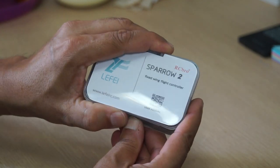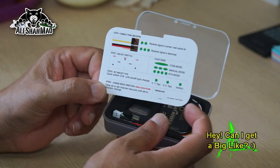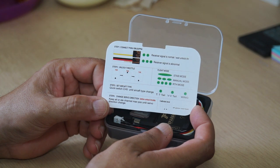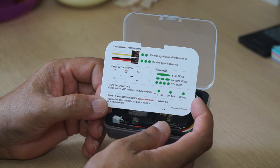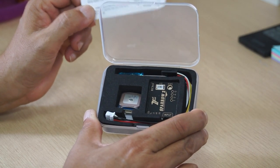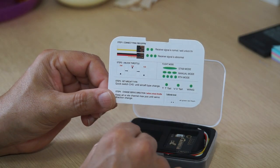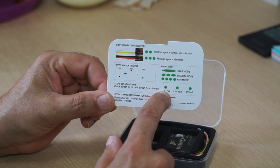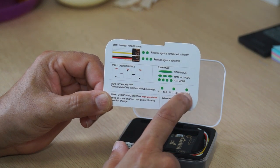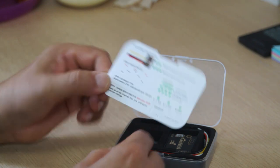Here is the Sparrow 2 from Love ARC. Inside the box you get a little card with a quick user manual at the back, covering connections for PWM, S-Bus, and PPM - yes, it supports all three. This Sparrow 2 also now supports a DJI digital video transmitter and camera connection - very cool. The guide shows how easy it is to set up for a T-tail standard aircraft, a V-tail, or an FPV wing, and how to switch aircraft types using channel 5.